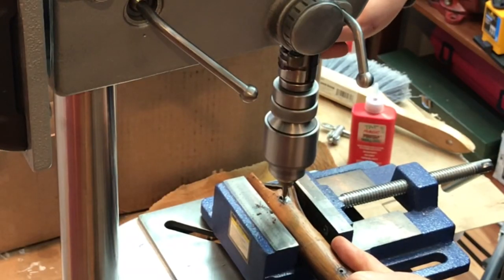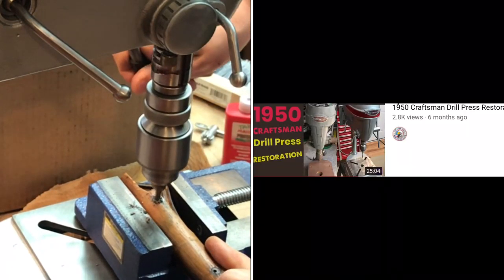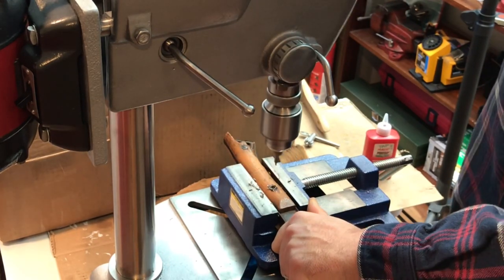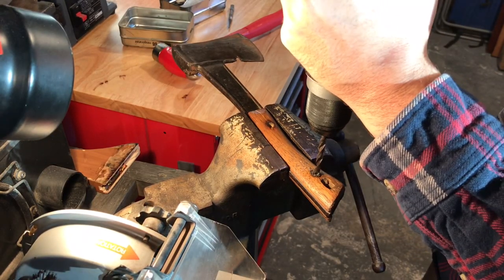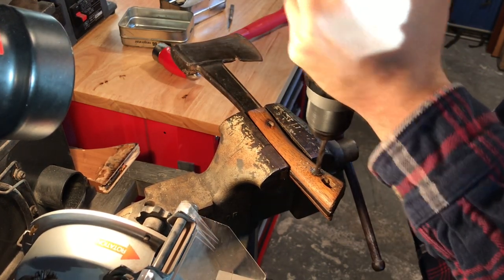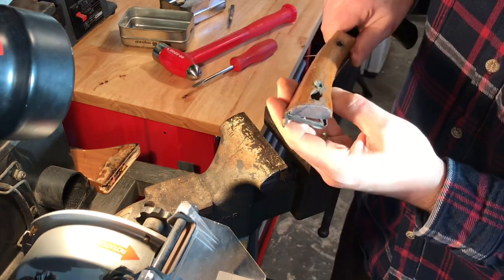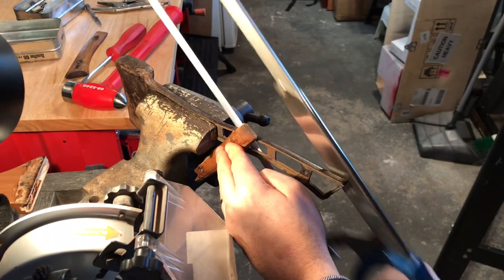Here I am on my 1950s Craftsman drill press, using a center drill bit to drill out those rivets. I was curious to see what those rivets looked like because I was going to need to find a solution to replace them. I finished them off with a regular drill bit once I got the bulk of the work done — they were in there really good, holding really tight. I had to pry it off, reposition it in the vise, and finish it off with a hacksaw cutting those last little bits.